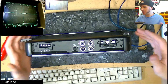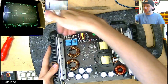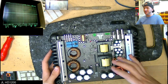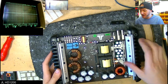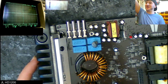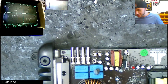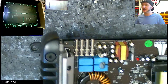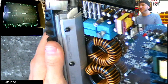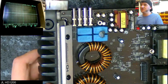Let's remove these sketchy wires. I've just popped the top case off — to get the top case off, you have to unscrew from the sides and remove the top, then remove the daughter board which has all the RCA preamp stuff on it, because it's completely covering this board. Once you remove that, you can access the main amplifier and power sections. What I noticed is we have a little stalagmite stalactite — a couple of capacitors here have failed. Actually, it looks like all four of them look kind of bad. This one has its internals oozing out of it, which looks like a scary protrusion from a horror film. The other four look bulged in varying intensities.